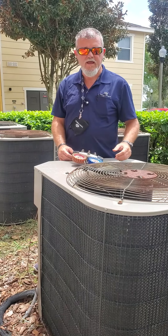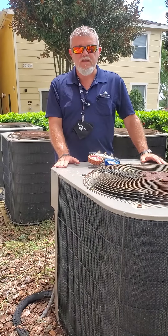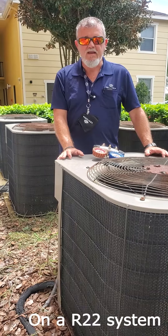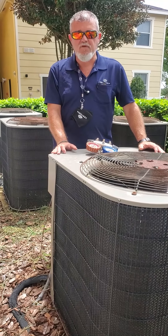Hi, I'm Don Cargill and we're going to try troubleshooting a TXV valve. Usually the first indicator is when you hook up outside to the high and low side — your low side is extremely low and your high side is like 300 to 400.